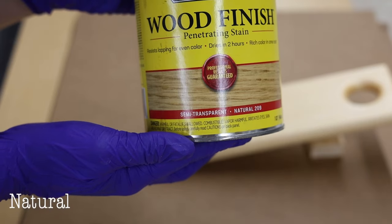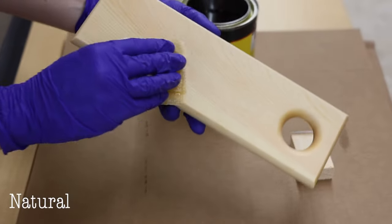Use a clean paper bag after top coating — don't use one with stain on it. I usually do one coat of Polycrylic for simple home decor products hanging on the wall. If you're doing furniture or a chair, one coat is probably not enough. For things designed to go in the kitchen, I use two coats to give a more durable finish.